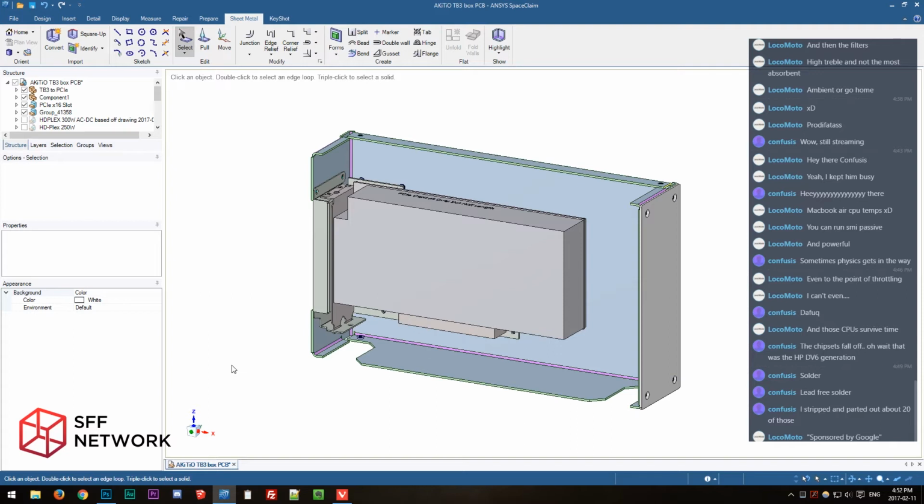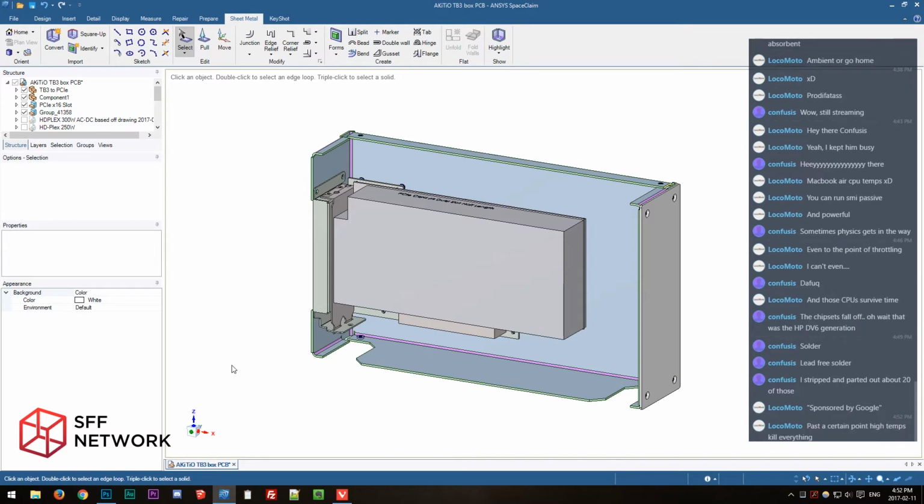But actually, I think their paper showed, counterintuitively, that running the hard drives a little on the warm side, kind of a normal operating temperature, like 30, 40 degrees Celsius, I think more like 40, they actually lasted longer than drives that had lots of extra cooling to make sure they ran at ambient temperature. I think what it was is that with the little bit higher temperature, the oils and stuff for the bearings were a little bit thinner, and they actually lasted longer.